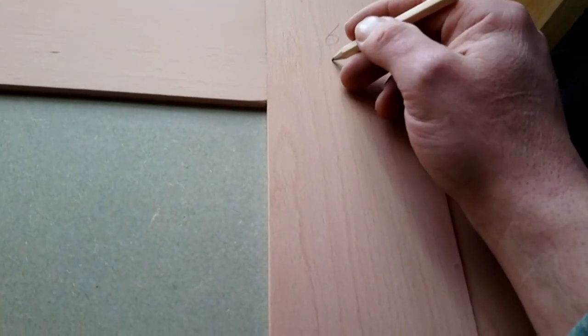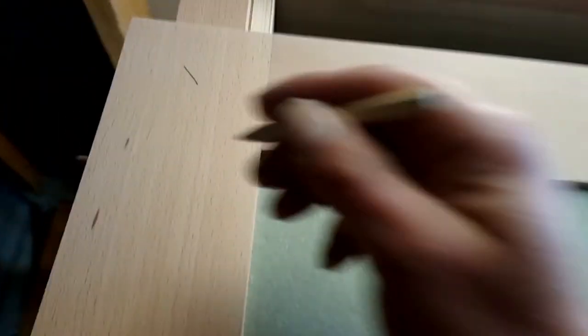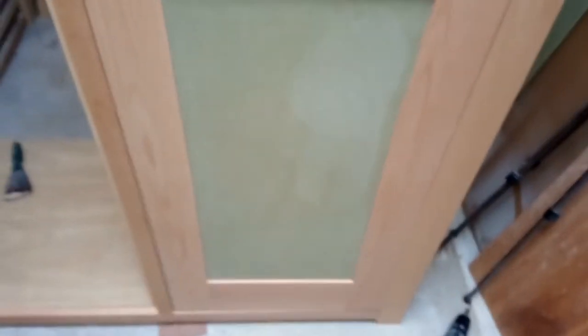I've stood these back up in place, got the numbers on. I'm going to put the H back on just to remind me which side is the hinges — H for hanging or H for hinges, whatever you want to call it. They're a little bit snug, there's not a lot of gap. Slightly bowed there — I'll pull all this straight when it's on the site. When I cut these rails I left the pencil line in, so I probably gained a couple of mil each time. I prefer them slightly too big — at least I can plane a little bit off, better than too small.